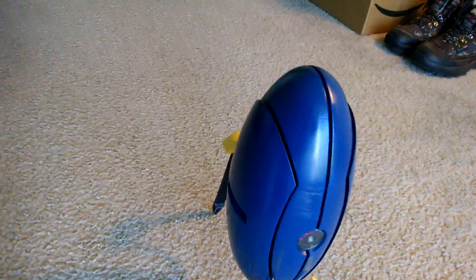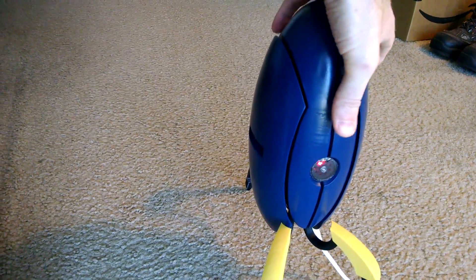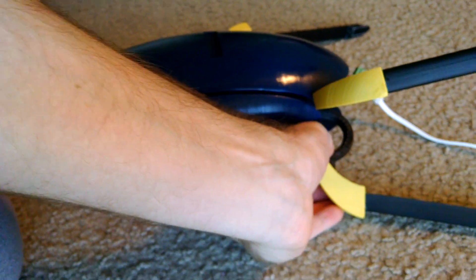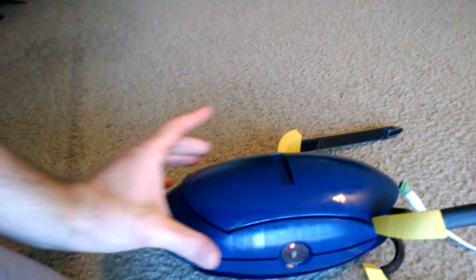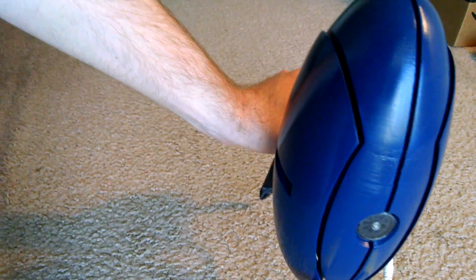Let me play that. When you right it and stand it back up, it will play one of the sounds as if it was either being picked up or launched. [Turret]: I don't blame you. So there it is on its side. I don't quite have the legs directly attached — they just fit into peg holes on the bottom. I made a pass-through for the wiring to come out the bottom. I was originally going to have the USB cable come out so that I could program it or power it through the Arduino's USB port, but there's not enough space in there. The power came undone so I guess you don't get to hear it doing the standing back up sound.